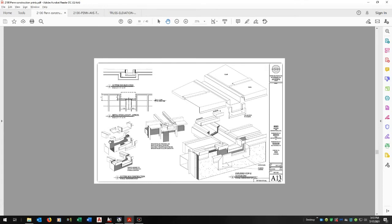This is exploded for the shop, not so much for you. This one is more for you guys: we're making this corner with the flashing as two pieces — a 90 down and a 90 up — and then straight lengths that overlap it. You can cut those and fit them as needed. Here's the track to the box, there'll be a cover in there; here's the cover; here's the collar piece that catches the liner and then fastens into the box.